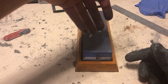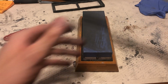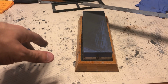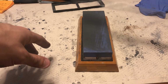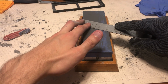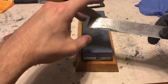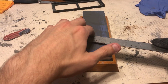We're gonna rotate. There we go. I do that just to make sure that some of the different parts of the sharpening stone that I didn't use are used. It's good to keep that rotated because in my infinite, omnipotent wisdom, I have not purchased the item that one uses to level a sharpening stone. If one does not do that, then after use, your sharpening stones will have dips and crevasses in them, and might not be the ideal medium to get your blades sharpity sharp, as one might call them.